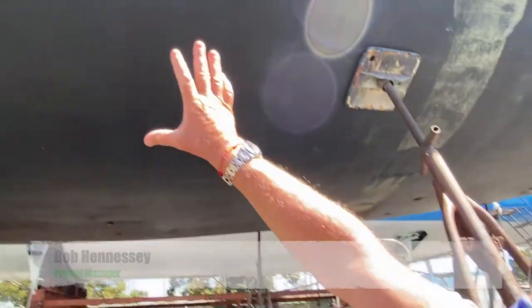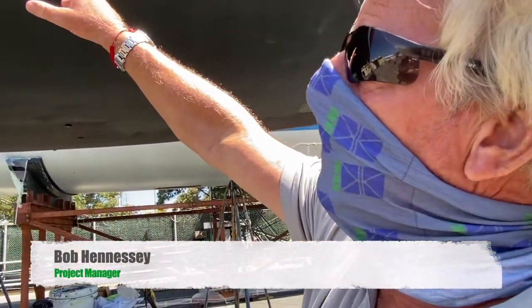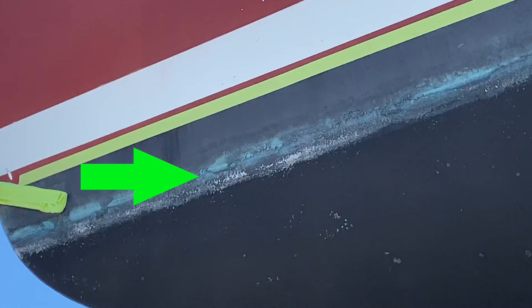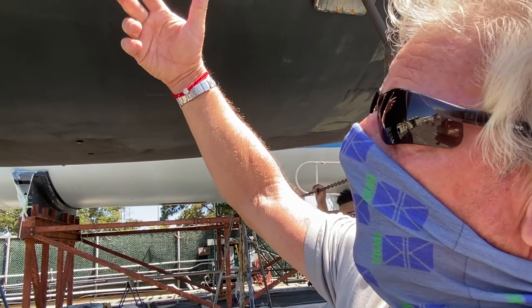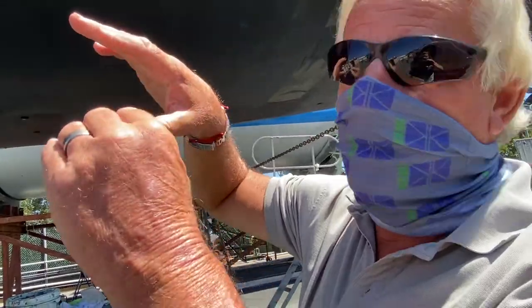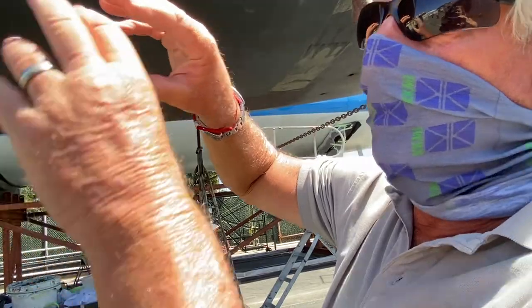What's happening is the Trinidad anti-fouling, or any anti-fouling — the stuff above the waterline and the stuff below the waterline looks completely different and has the look that something's going wrong with the paint. What it is, is the paint down here is working, oxidizing and keeping the growth off. The stuff above the waterline, even if it's getting wet periodically, is drying up and then getting wet and drying up again, giving it a completely different look.